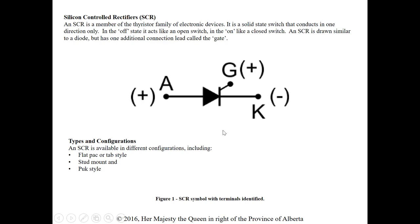I'm going to go through controlled rectifiers here. One of the biggest things to talk about with the control part of this rectifier is that when we talked about diodes, we talked about the diode being forward or reverse biased. When it was forward biased it conducted, when reversed it didn't and acted like an open switch. When forward biased it pushed the whole alternation through to the load.